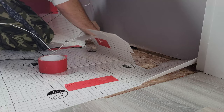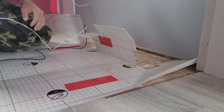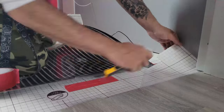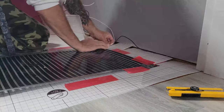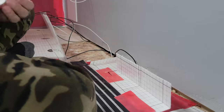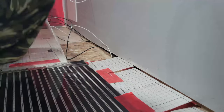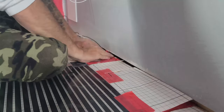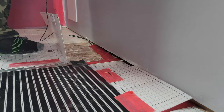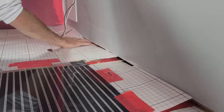This tape is just any type of flooring tape you'd buy from the store — it's got a little stretch to it. I'm not exactly sure what it's called; it's just what I was recommended to use from Home Depot. You'll want to carefully take your time and make sure all your wires aren't crossing over each other or creating extra bumps, because once you've got everything taped down and the floor installed you can't go back to fix something. Make sure you double-check that you've followed all the instructions in the book, get all your wires together, carefully place them down, put tape over top, and feed the wire through your conduit in the wall.